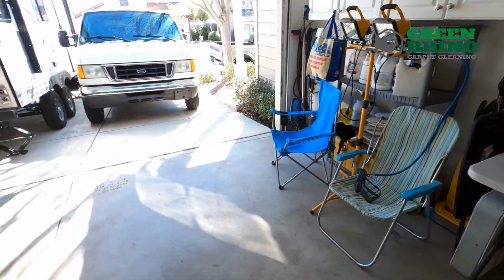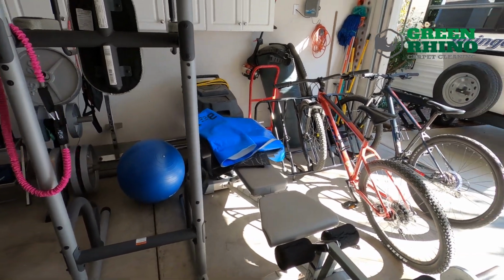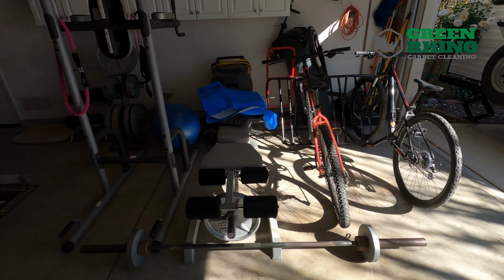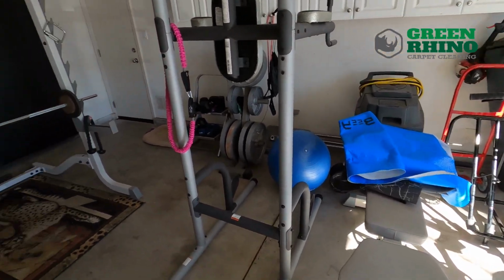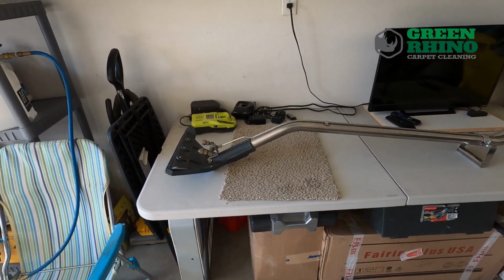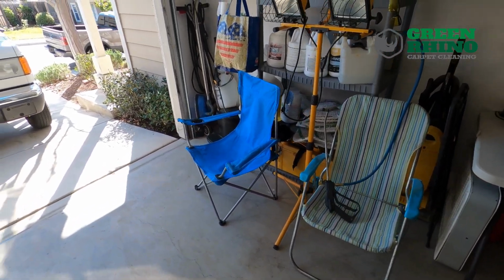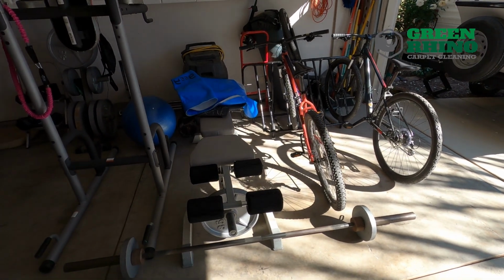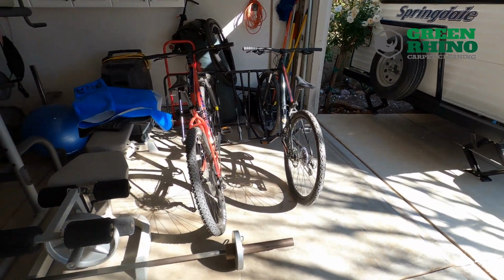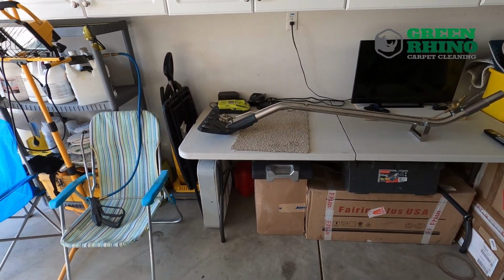So I believe if you're going to do VLM, invest in a nice portable, something that's got a lot of power. Washington Pro Carpet Cleaner, real good guy, just like me, shares a lot of information and is not selfish with it. He's got a good setup. He's got a vac boost and stuff, and that means just drier carpet when he's done with the job. If your chemistry is good, you're going to be good. And always, if you have a portable and you're worried about leaving the carpet a little too wet, you can go across it with the bonnet and leave the carpets drier. Turn the ceiling fan on. But anyway, I think I'm getting a little off point here.